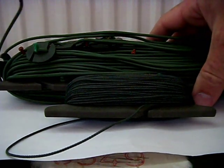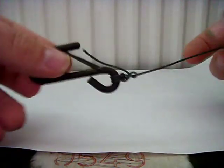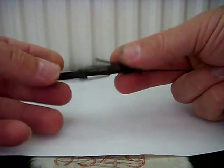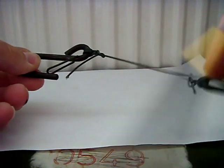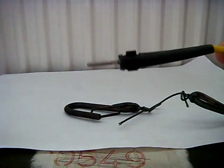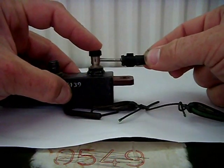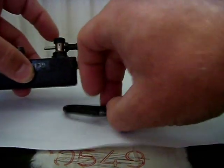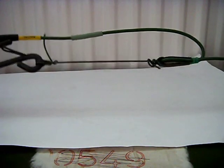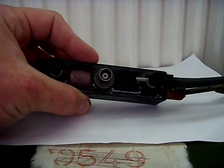This is one half of a dipole element. On the end of the wire we've got a nice catch with a clip and the probe. These go into the dipole centre that we see here — in goes the probe and then you'd clip on the dipole centre so there's no tension on the wire itself. This one is BNC fed.